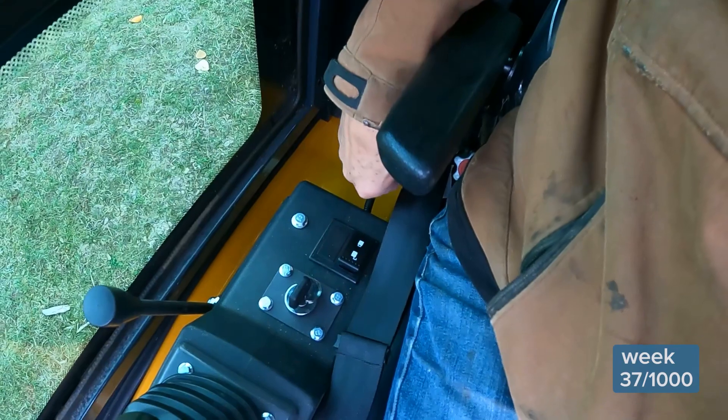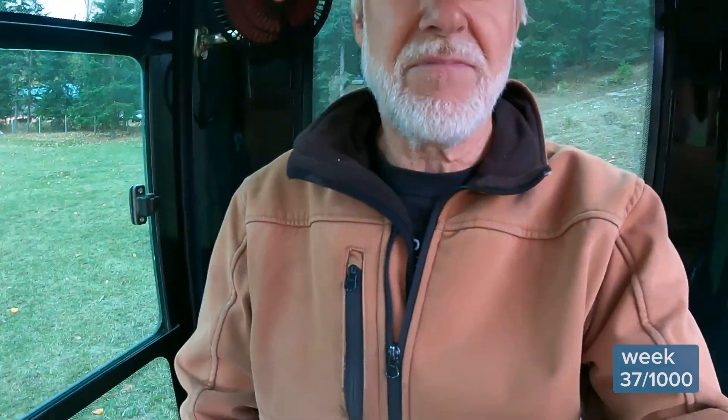The manufacturers of excavators have a hydraulic lockout so that one doesn't inadvertently cause a motion on the excavator that could harm yourself or someone else. The only way to lock out the travel and the blade hydraulics is to do this. There — now I'm locked out.